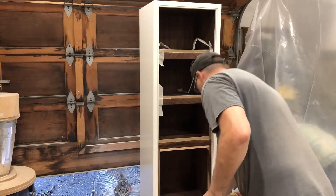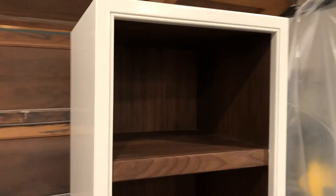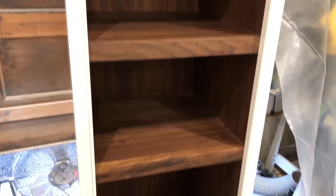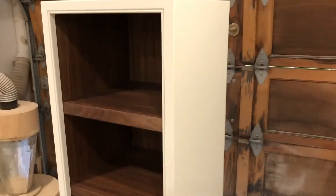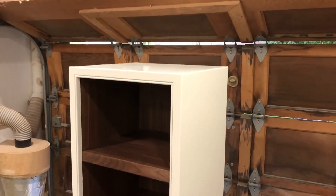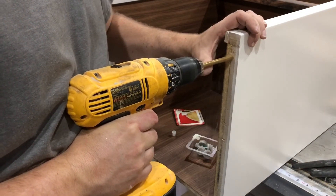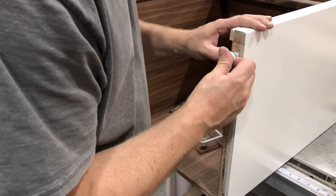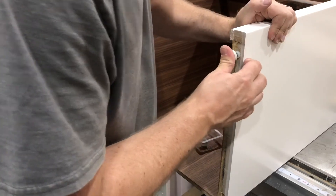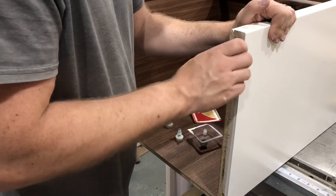Pull off the masking paper and there's the cabinet. The masking did its job — everything's nice and clean on the inside. Because I pre-finished the interior, I don't have to worry about getting the outside oily and greasy from that linseed oil. The only step I have left is to drill holes in the bottom and put in feet — standard plastic inserts with a screw-on felt foot, which is perfect for the hardwood floors we have in our home.